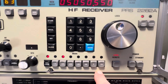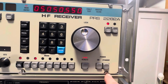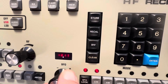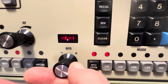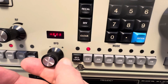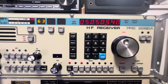Down here you have different modes. This one adds FM mode over the 2080, so that's another difference. Local/remote, and you have on and off like we saw when we turned it on. If I were going to do CW, you see how the numbers are very tiny. The BFO lock is on, that's why.